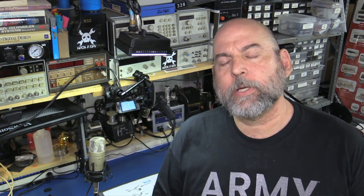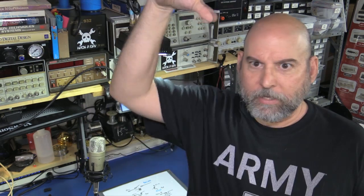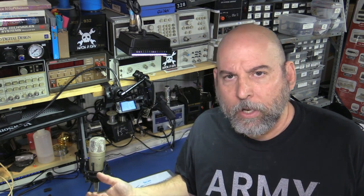High side switches — we're going to do it simple. A high side switch switches the VCC, the voltage that is highest. In digital electronics and some analog, we're very comfortable switching the bottom — open collector outputs, we pull the ground. Ground is a known entity, usually low impedance, usually low noise. So we do a lot of connecting the ground to something to turn it on. There are times when you want to actually turn the power on to something. What might be some of those times?